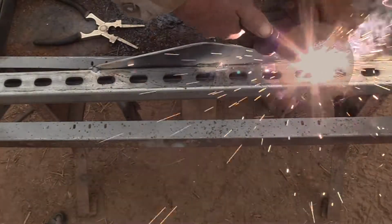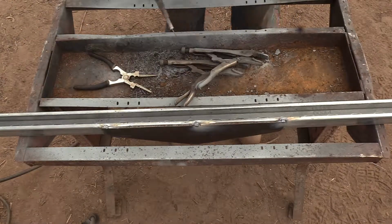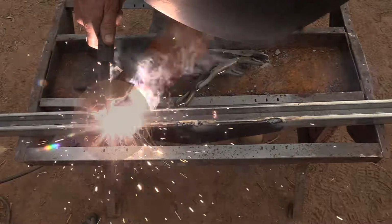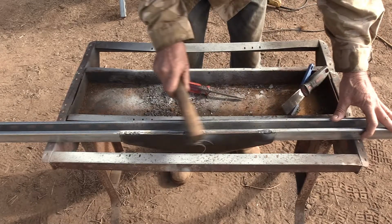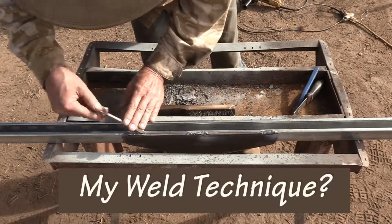Welding seems so quick and easy, but really it ends up being a lot of cleanup and paint work to restore the galvanized protective coating so these parts don't rust. The other bummer is that this kind of welding, where it's flux core and there's no gas involved, splatters really bad everywhere. Little tiny blobs of welding splatter are slightly stuck on all over the place.